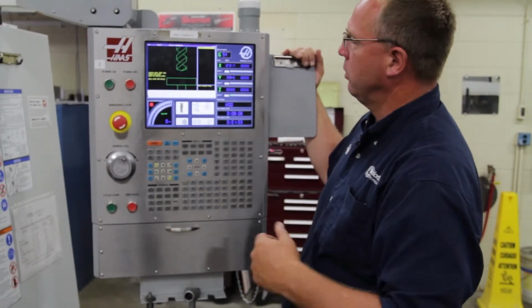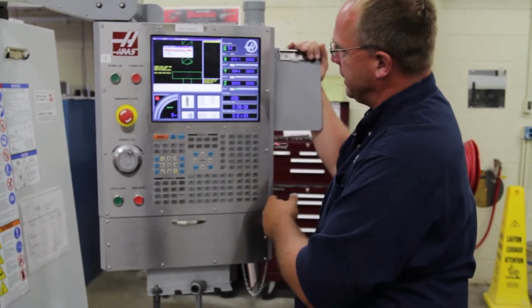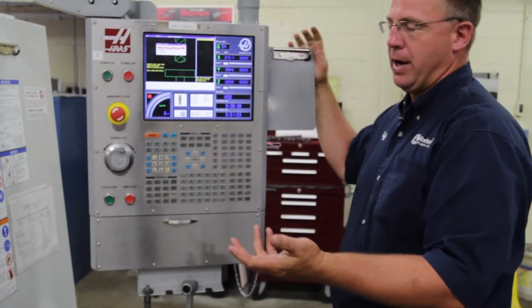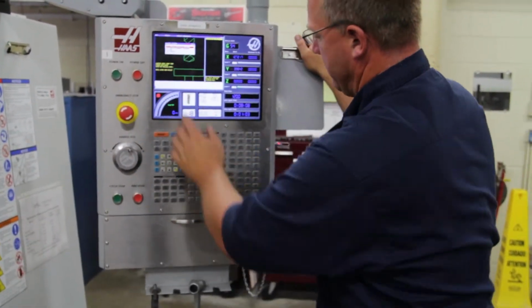It's asking you what tool number. It's in tool number 19. Even though tool 18 is in the spindle, that drill is in tool 19. Okay? This is an auto length drill, so you do not have to tell it approximate length. So we're going to close our doors. Once again, we're going to use MDI.